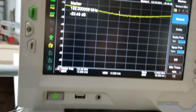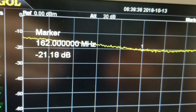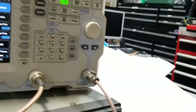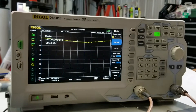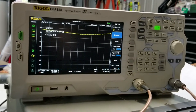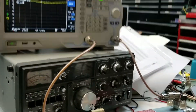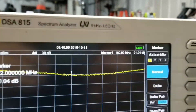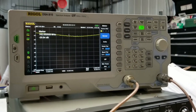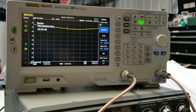We're getting basically minus 20 to minus 21 dB. Looking at the chart, 20.84 dB corresponds to a SWR of 1.2 to 1 — very good. So that's how you test the SWR of any antenna. The Rigol is good up to 1.5 GHz, so you can test all the way up there. This is a video by NK0T and W0GEN.